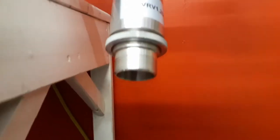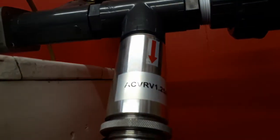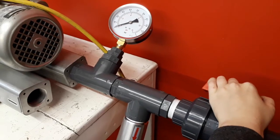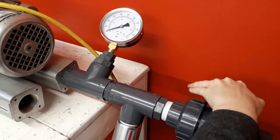In this case it is set up for pressure operation, where the arrow on the safety pressure relief valve is pointed away from the inlet of the pump, showing the direction of the air flow. The function of the ball valve is to adjust and restrict the volume of the air flow to the pump.